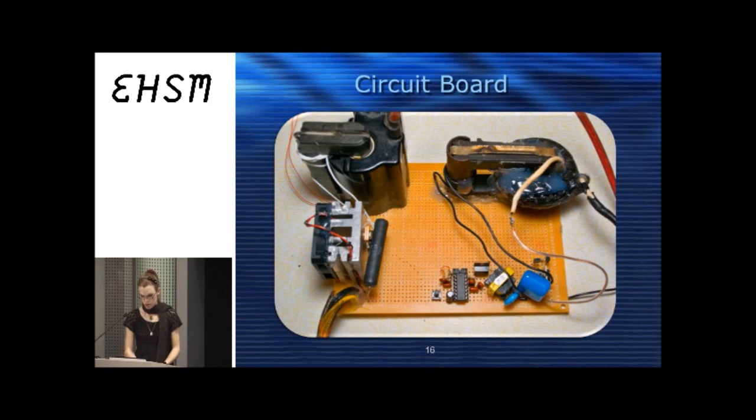Normally you'd get 10 to 25 kV out of a flyback, but you can actually get 50 kV for a very short amount of time — and that is for the trigger electrode. The circuit board uses a very old-school CRT flyback for the trigger. 50 kV can leap quite a distance, so I had to pot the whole thing in hot glue, which worked for a time, then switched to RTV — a more permanent solution. To the left is a power MOSFET that switches the supply into the flyback. It requires a car battery — you can't get enough current from a switch-mode power supply. I've since popped it from 18,000 volts to 30,000 volts to fully charge the Maxwell pulse cap.